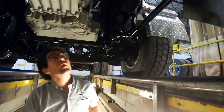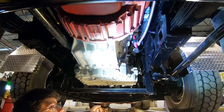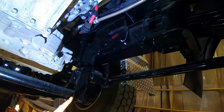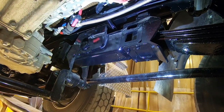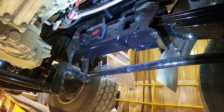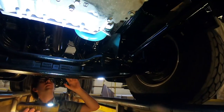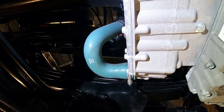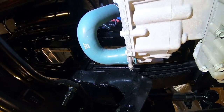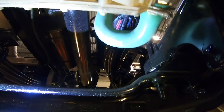Now we're under the TerraPro. This truck has an Allison transmission that we can see here, and we can have a look at the suspension itself with the equalizer underneath — all the pins and bushings that can be replaced or serviced easily. We also had to work on the cooling system of the Allison. We always advise the client accordingly to make sure we have the right spread. The 74-inch spread in this case was about the minimum; there's some loose space, but to ensure the truck works well we advised going with this front spread.